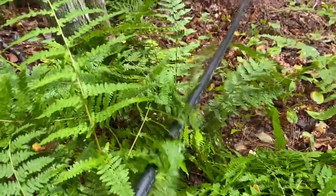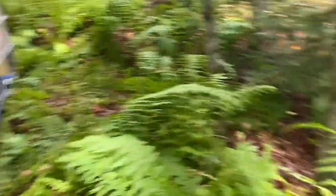I could run this intermittently if I started to draw that pond down — just every other week for three to four days and these totes would fill up, plenty of water. We are about 30 vertical feet above the garden, about 20 vertical feet above the seaberries we water, and about 15 to 25 vertical feet above the top of the pasture — the highest I'd ever need to water my cows from. The garden is the key use zone one, and the next is watering our big seaberry orchard which is in a really dry spot.